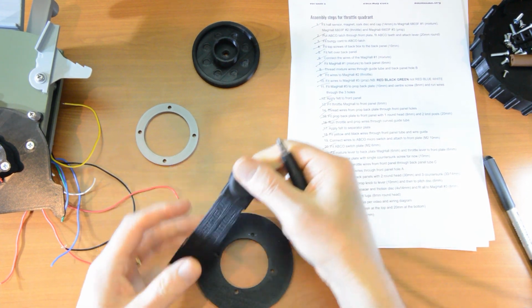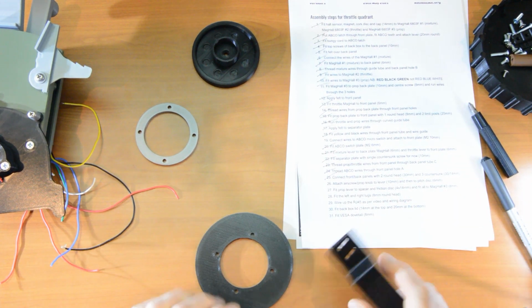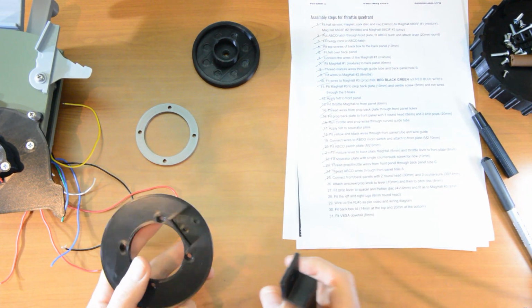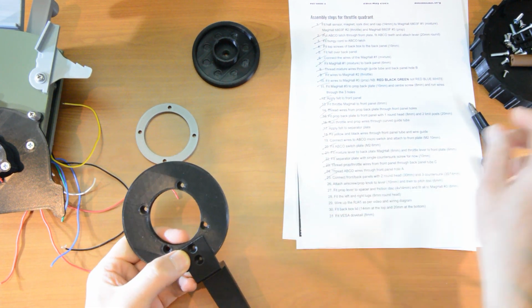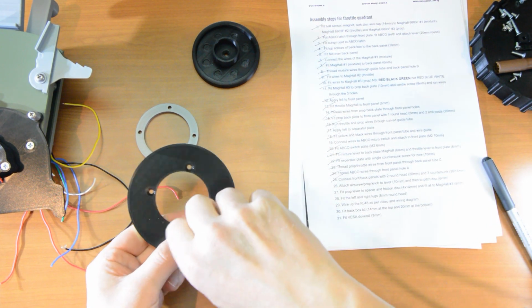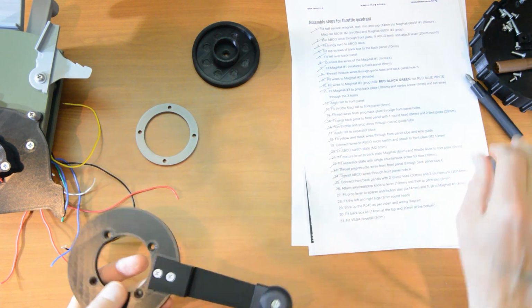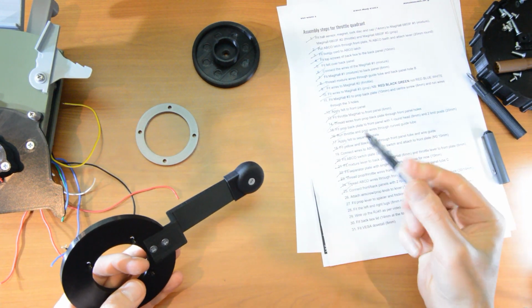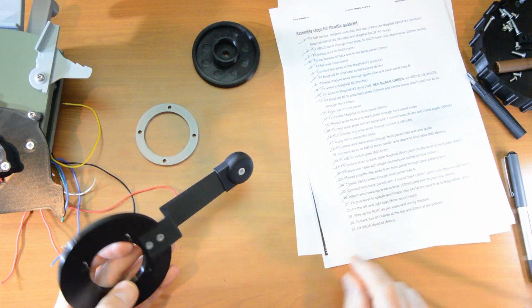Okay, that's the prop knob. And then to the pitch disc. That's the pitch disc. So we use 6 mil here. Okay, that's 26 done. Now the prop lever to the spacer and the friction disc.